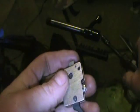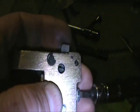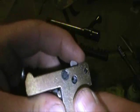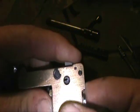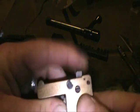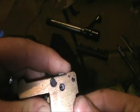You can physically watch in that sight window when I adjust this screw - you can actually watch that trigger move as I turn it. Now it's pretty close right there. I'll push down on the hammer to simulate the gun being cocked, then pull the trigger - the trigger is just barely moving, it's real light. Polishing that surface in there made a real crisp break. When you get to the edge, make sure you sand it down to a real sharp point - don't make it rounded. That way when it gets there it breaks crisp.